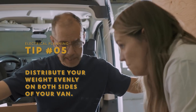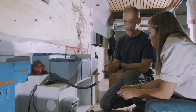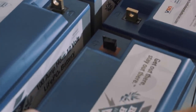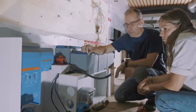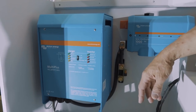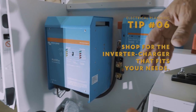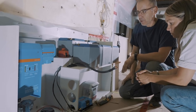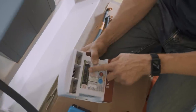This might be lithium battery, but there are already six of them, so you're nearing 200 pounds of stuff right here. Obviously with this type of setup, it's not always sunny, so we're going to go with an inverter charger — there's one there that's probably the most complete one in terms of what it can do. You need to take that power and distribute it. The power is going to go from here into the inverter charger, into the distribution center, and out to all the components.